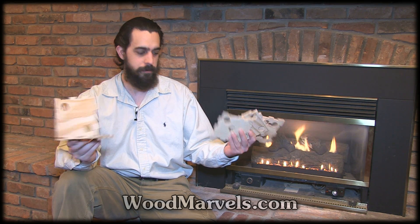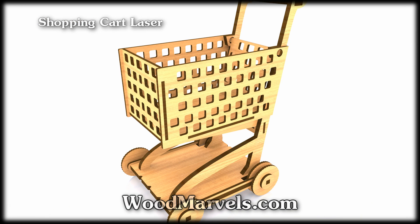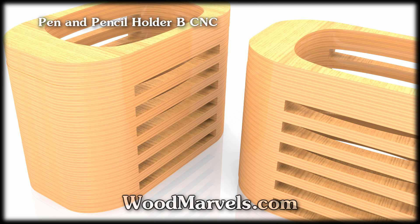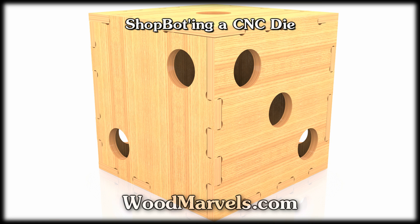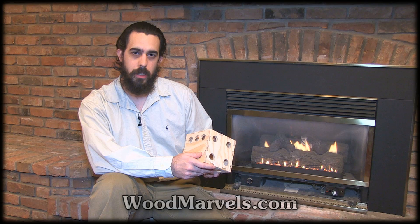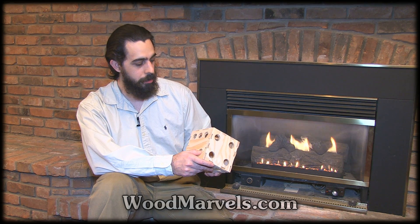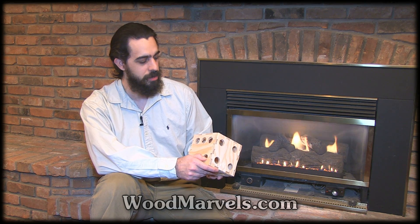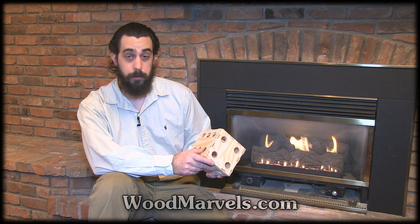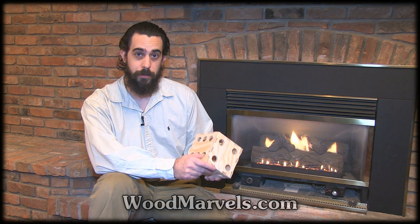Looking for a fun CNC puzzle? I got just the project for you. This CNC puzzle die only works in one combination. All you need is one sheet of plywood, 500 x 400 mm, 6 mm thick, a 1/8th straight double flute bit, a CNC router, and as much time as it needs for you to figure this out.